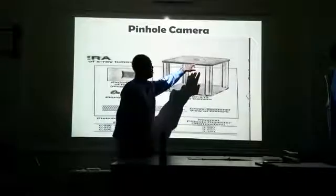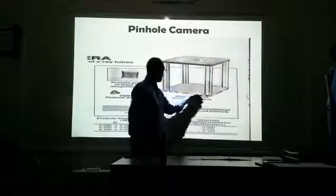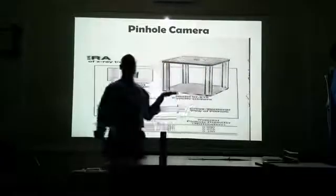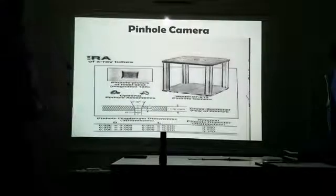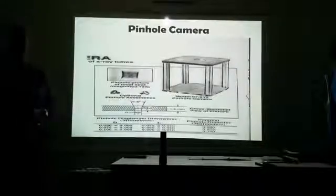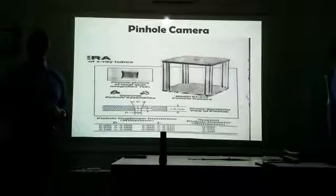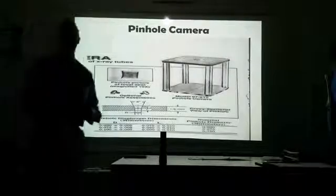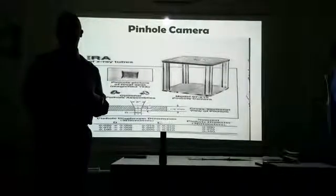One of the panels here — this is what we're going to x-ray. We're going to shoot our x-ray through here, and the film is going to be underneath this test tool. So we're going to take an x-ray of this test tool. What are we going to do with that film? It goes in the processor, and we're going to analyze the effective dimensions of the focal spot size.